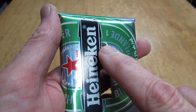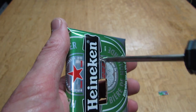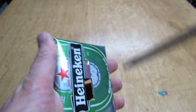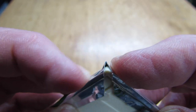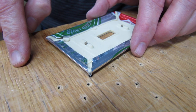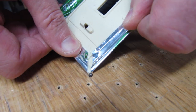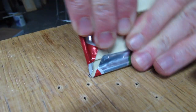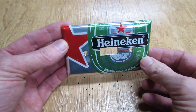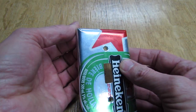You don't need to do much more with the screw holes since the screw already created a hole, but if you want you can take a pointy tool and smooth them out a bit. Now deal with the sharp little corners left over from folding the metal. Do this on a work surface, not a good surface, because it will leave marks. Just take the plate and rock it back and forth — as you get to the corner it'll slowly flatten out the metal. There you go, that turned out pretty good! If you have any sharp edges on the corners, just roll it on the table like that and it'll smooth them right out.